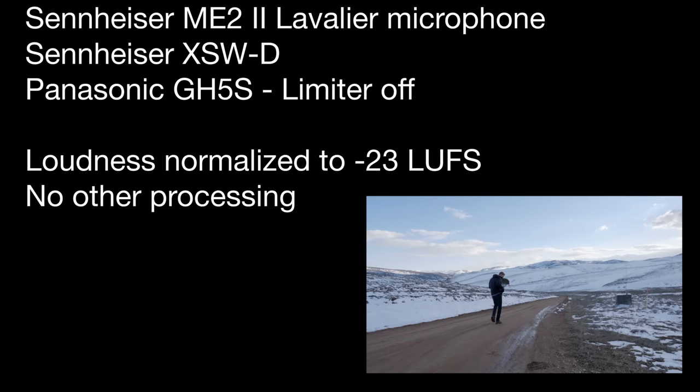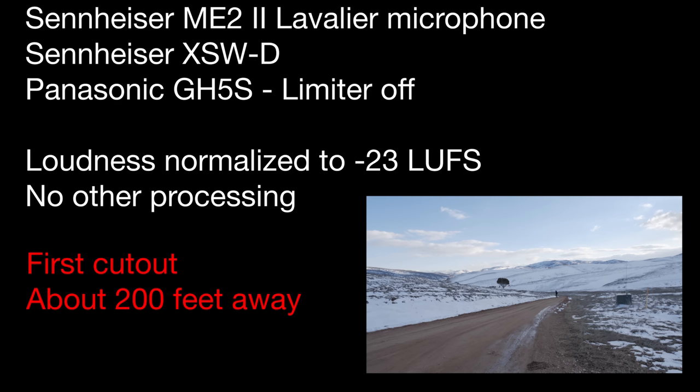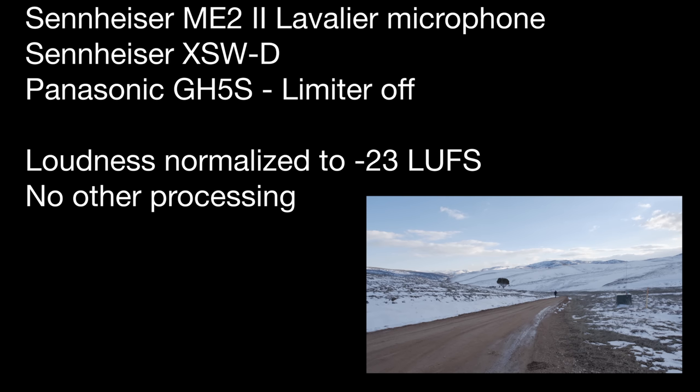Okay, we are going to do another test — an outdoor distance test. The idea is I don't want anything nearby that the signal could bounce off of. No walls, no buildings. The closest building is about 200 feet behind the camera. I'm wearing the transmitter here. I'm about 25 to 30 feet away right now, and I'm going to walk this way — walking down the hill. We're probably picking up some wind now because I've got the wind in my face. This will also give you an idea of how the microphone sounds when you've got wind blowing across the capsule. It's a little bit protected but not much. And at this point I think we're probably a little over 100 meters.